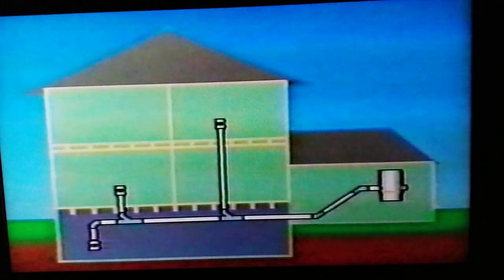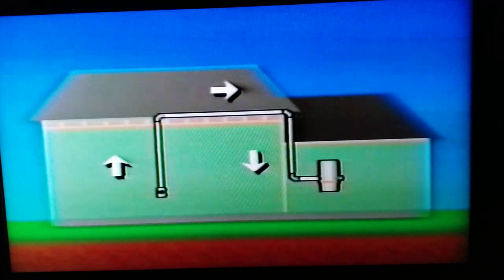Plan the entire pipe installation from the power unit to the selected locations of the inlet valves. It's best to run the pipe under the floor where possible in structures with basements. Sometimes this is not always possible, so you may have to run the system up into the attic and over to the power unit. It's essential to cover the pipe in the attic with adequate insulation to prevent condensation from forming in the pipe when the weather is cold.